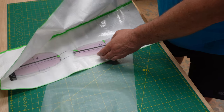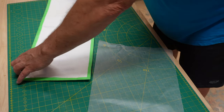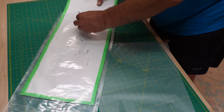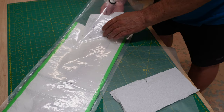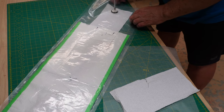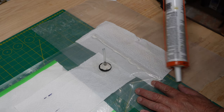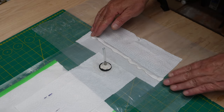That's a breather bag I've made out of a piece of plastic poly with paper towels over top — it's very excellent, I highly recommend you make one too because it makes releasing very easy. Everything goes inside the vacuum bag. The breather bag is a little short of the vacuum valve, so you want a path for the air to get to that breather bag — that's why I added the extra piece even though the bag's got dimples inside for that.